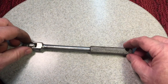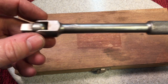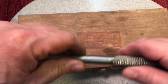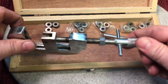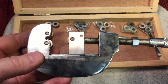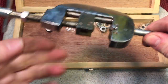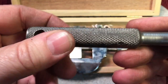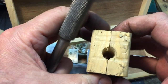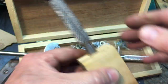Because of the head, we can't chuck this into the lathe, so we're going to have to figure out a way to do this. Years ago I bought this set — it's called a hand knurling set. It looks basically like a pipe cutter that you'd put here, and it has knurling wheels and you do it by hand what you'd normally do on the lathe. It's got a threaded portion on top where you put a bar in to give you leverage to turn it around. I don't think I've had much luck with these, especially since we're trying to go over already-knurled parts. To hold this in the vice — because it's round — I just took a piece of scrap wood, drilled a half-inch hole through the middle, and cut it with the saw down the middle so I could put it in and squeeze it to hold it from slipping.